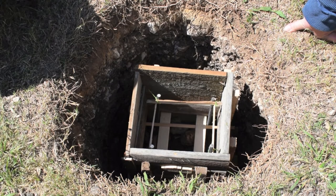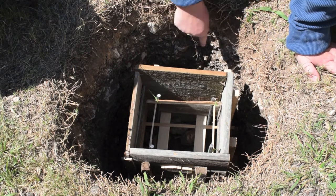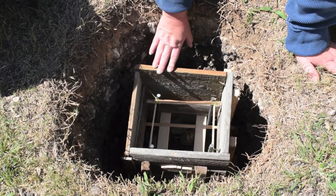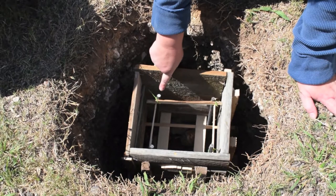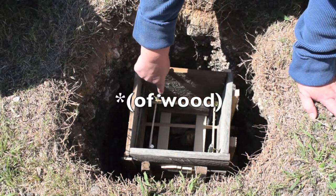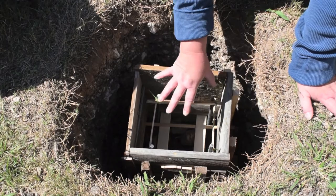Let me show you what we've done to prepare the hole. We've dug a hole which is a little over two feet deep. The posts are eight feet and we want the line about six feet high. We've got a box on the bottom made out of wood which is 12 inches square by six inches deep, and then another box on top which is eight inches square by 18 inches deep — this is our form for the concrete. We've also put in half-inch rebar: four pieces going down at least 18 to 24 inches deep, and two pieces going across each way for a good reinforced square. We're going to place the post in here to square it up and pour concrete, using quick-set mix.